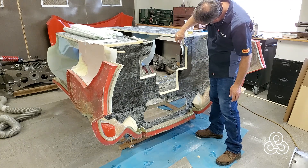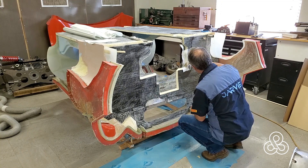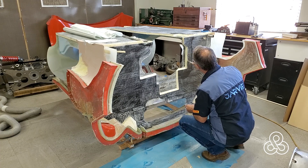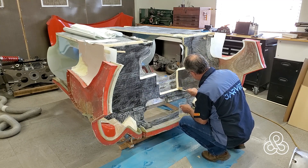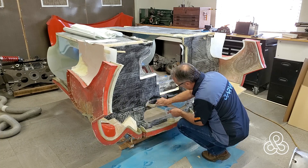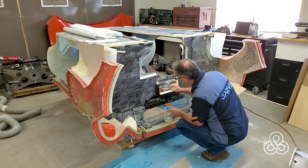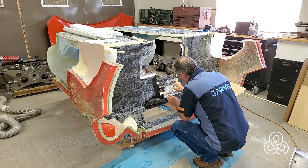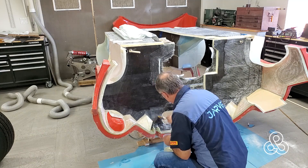It takes a little while to work some resin into the foam and work the cloth down nice and flat into those areas to make that transition around those 45 degrees. There's a little bit of paper from that craft paper on the foam that sticks out — we're going to keep our laminations going up across that to give us a little bonded edge. I throw some resin on the surface first; once you have resin on there it helps saturate the cloth and hold it in place while you add more. Then pick up another piece of twill, stick it on, and keep working all the way around this edge. Once that foundation layer is on, the next layers are much easier to laminate to.